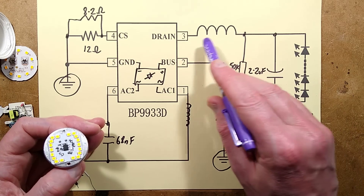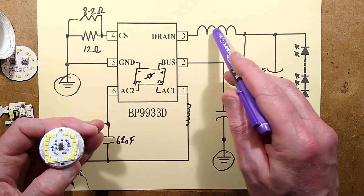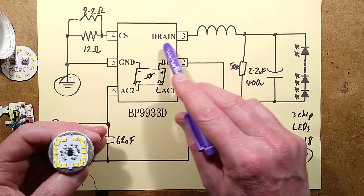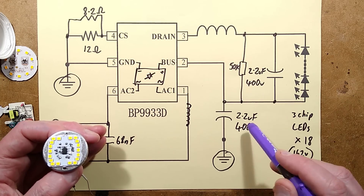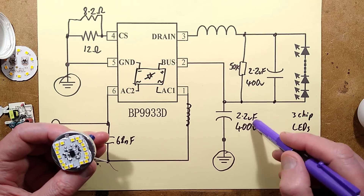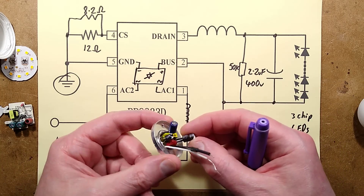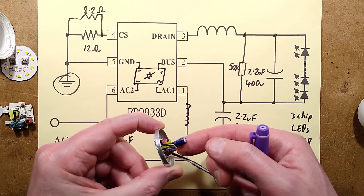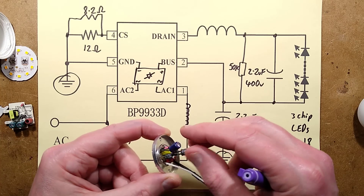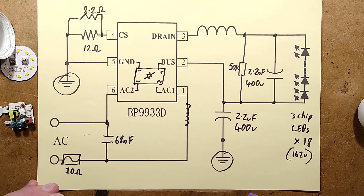Once again it will have a little diode in there so that when the inductor is used to bridge to the zero-volt rail and the field collapses, the energy is diverted back to the capacitor for maximum efficiency. In this case they've got 2.2-microfarad capacitors for both rails, but they're completely different capacitors — a little brown one on the output, possibly a low-impedance type, and a different one on the input. They're really quite small for the value — suspiciously small — but at least they've spaced them off on long leads to try and avoid them being overheated.